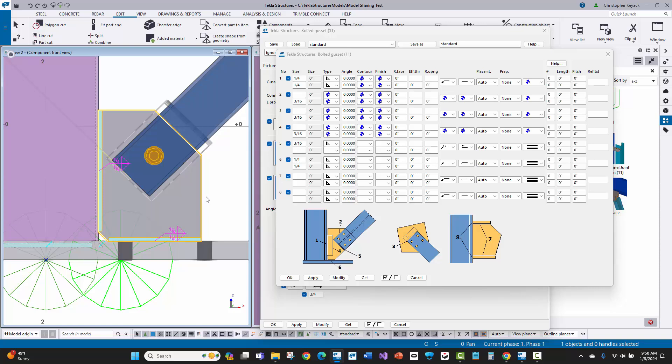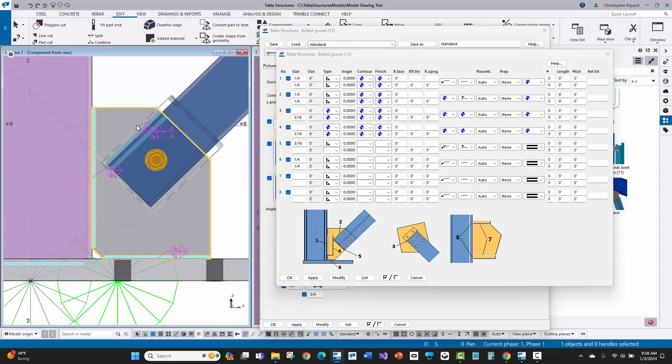Whether you want to show the field welds is up to you. For weld number two, we'll do quarter inch near side, far side, set to fillet weld, and definitely a field weld. We can also put in the weld length so it shows in erection sections. For weld number two, I want a minimum 4-inch weld length based on what the engineer specified. We have a 5-inch lap of material on the slot, allowing the weld to start away from the end of the brace and edge of the gusset, giving a 4-inch long weld. This model weld can then appear in erection drawing symbols.